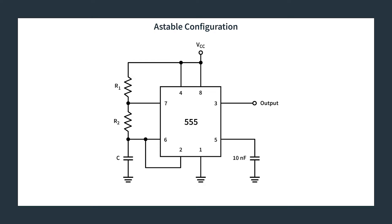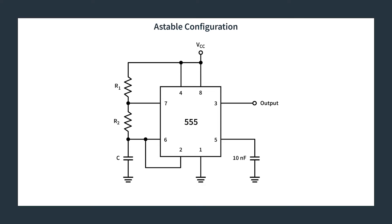The more interesting stuff is on the left side of the pinout. The most interesting thing to note is that pins 2 and 6 — the trigger and the threshold — are tied together. That is where you get the instability, because you'll cross one threshold, be in a kind of no-man's land, and then cross another threshold that causes it to change states. Most of the interesting stuff happens because pins 2 and 6 are combined. Also, pin 7, the discharge pin, comes into play just like in the monostable configuration.